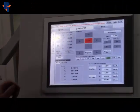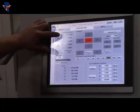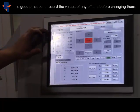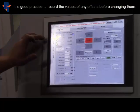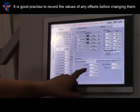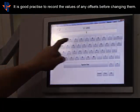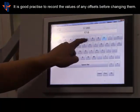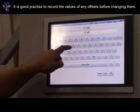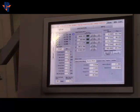On the Arbor to Nozzle, after you've touched both points, your X will be the value you need to take. Go into setup, then the advanced screen, machine offsets, Arbor to Nozzle — it'll be 17.094. Hit OK. The system will power off.